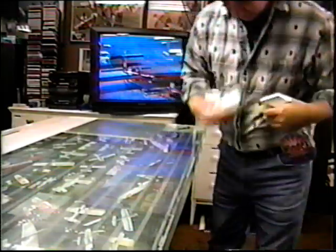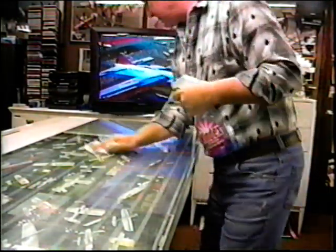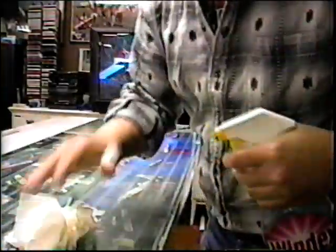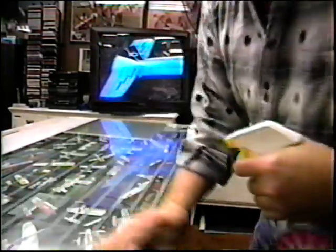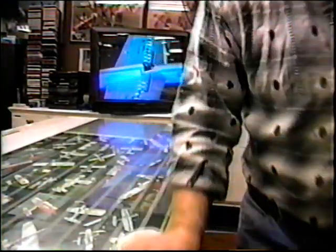Usually on your shirt when you're sanding, there's always a bunch of dust. I go outside and blow that out. Because any of this dust that winds up in the fiberglass, you get all these little lumps and chunks, and once they're in there, by the time you sand them out, you've broken through the cloth and lost some of the strength. It's just easier to do a good cleanup before you start any of these glassing jobs.